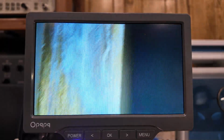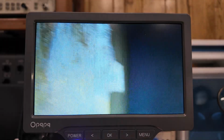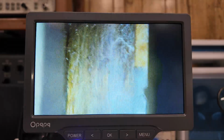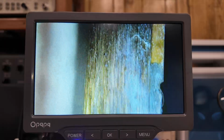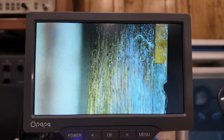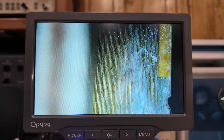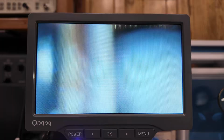Look, I would love to use some DeoxIT or something of that nature on this. The problem is I'm afraid over time it could play into either the bonding here on the paper, anything holding it together, or potentially the enamel on these fine wires. So I'm going to try to do it with maybe a Q-tip and some white vinegar that would help neutralize this corrosion.